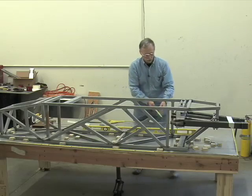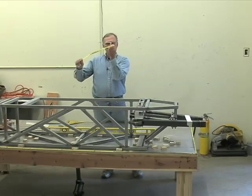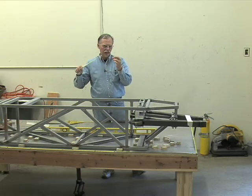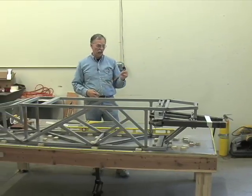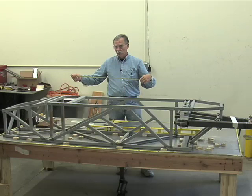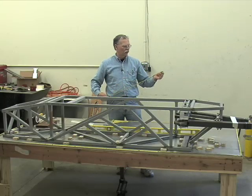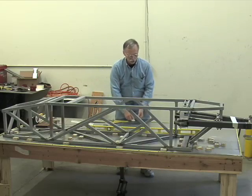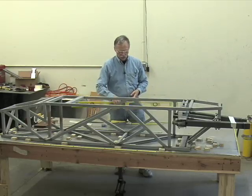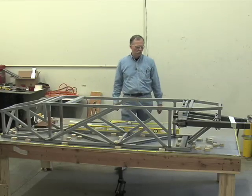If you're trying to measure by butting it up against a wall, like this, it slides in and tries to correct for the thickness of the 90-degree catch. That's why it moves, to correct for the thickness of the 90-degree catch, but it's not real accurate. So if you're going to use these, be very particular and double check your measurement. Measure twice, measure this way, measure this way, and make sure they agree. If they don't agree, then that's the error in these kinds of rules, and you have to watch that. You're always better off using a long one-piece rule that will span the job you're trying to do, or using separate measurements the least amount possible.